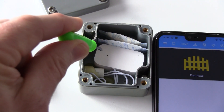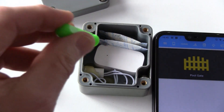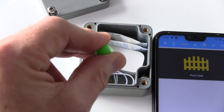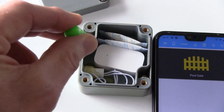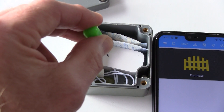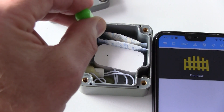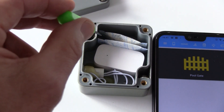To make it more sensitive to the magnet, I've done two things. I bought a cheap little reed switch off AliExpress, which I've hot glued in here, and I've actually wired that across the reed switch which is inside the Xiaomi sensor. I wanted the box to be small, but I couldn't get the Xiaomi sensor close enough to the edge without compromising the physical characteristics of the inside of the box and possibly damaging the waterproofness of it.